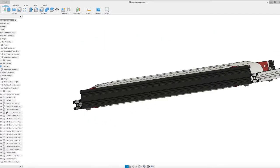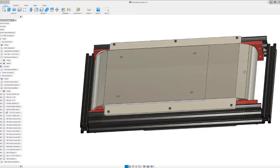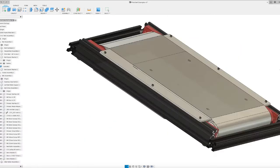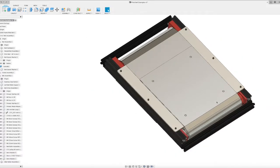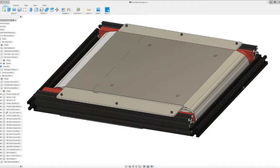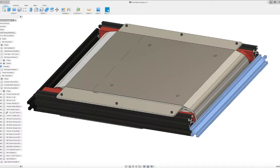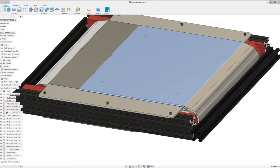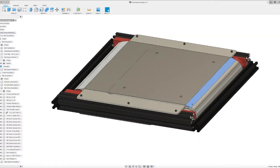This is just a slightly different approach, and I actually kind of like it. So let me go through the differences without recovering the same ground. First and foremost, it's wider — it's based off of utilizing as much of this heat bed as possible. You cannot source a nine-and-a-quarter-inch wide stainless steel shim stock off McMaster-Carr; it's actually 12 inches. So I'm going to have to cut, which means one side is going to be factory and one side is going to be sketchy.